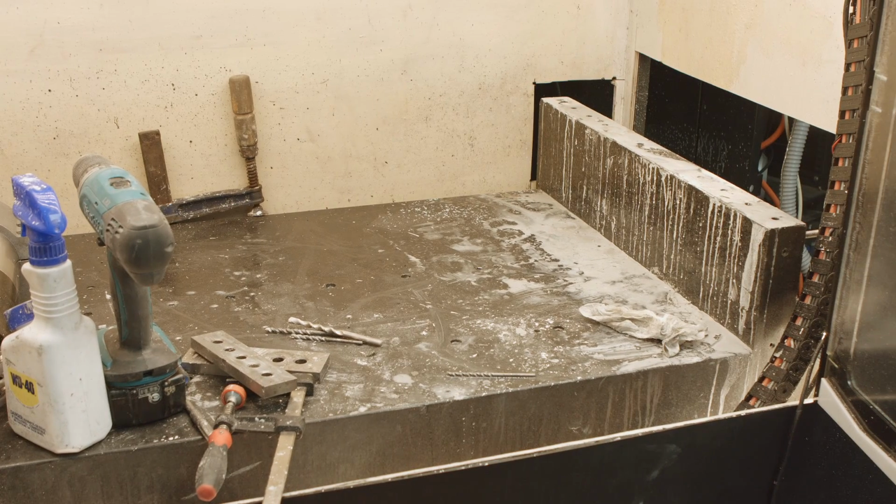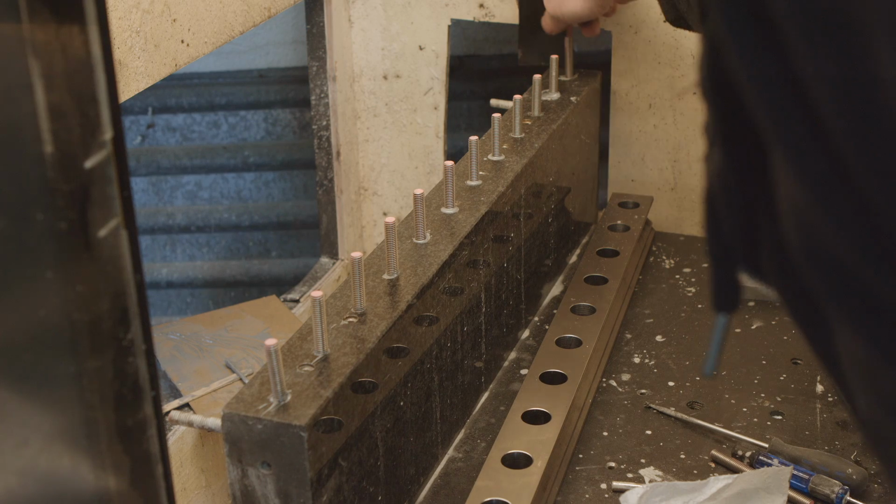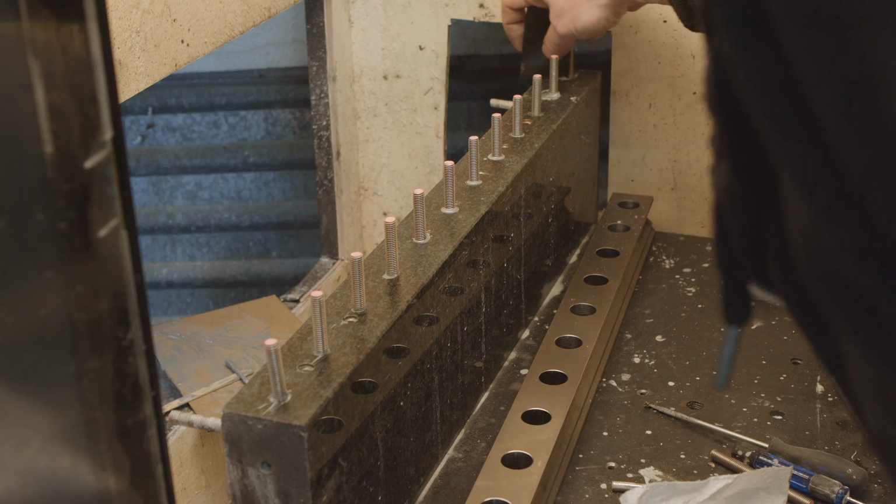So that's how it looks after drilling all the holes. Now you're gonna be putting threaded rods. So I have to clean it, blow the holes, dry it, and install the rods. I put all of the inserts, and now we're gonna scrape the excess around.